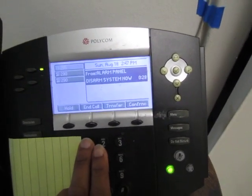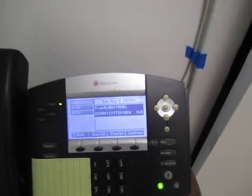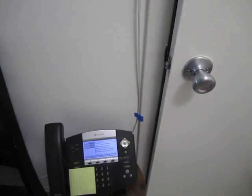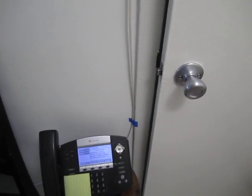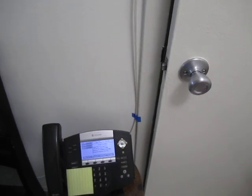And if we go ahead and enter our super secret pin, we can disarm the system. So that was the confirmation tone that you heard there. The confirmation tone indicates that you've successfully disarmed the system or performed whatever function. And the crybaby or howler tone, as it's sometimes known, I thought was just perfect for an alarm sound when the system is in alarm.